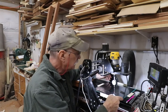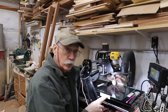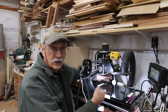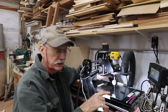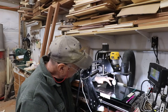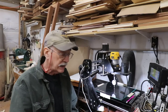The plate is on the platen for the CNC machine. I'm holding it in place with some double-sided tape and quarter-inch pieces of wood. I found the center of the piece of glass, indexed the router head to the center of the glass, and set that as my zero point so I can get back to it quickly. I've got the dial indicator in place, and now I have to run this from corner to corner to find the highest corner and then shim the other corners to that.